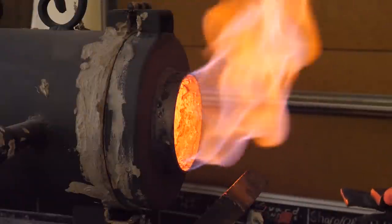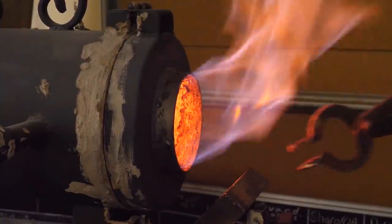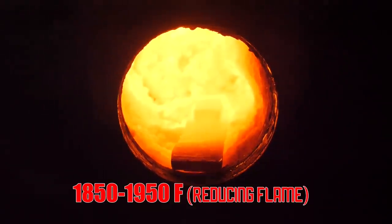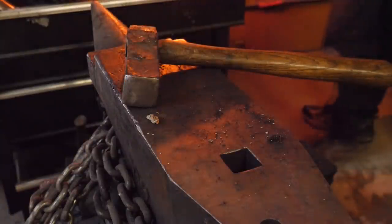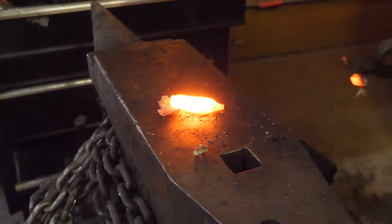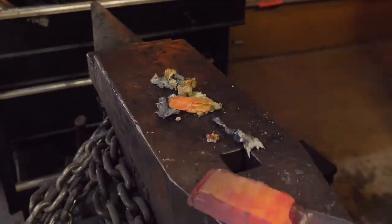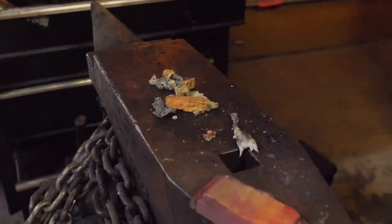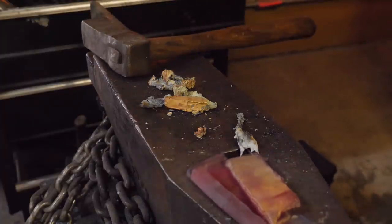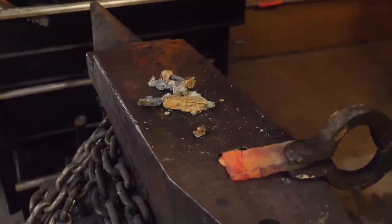This time I'm dialing in a reducing flame — one that has more fuel to consume than oxygen available. On my forge, this flame has a blue-to-orange tongue and a dull hollow roar, and that's how I know it's a reducing flame. As you can see, despite the high temperatures, it's not oxidizing this time — that means we've got all or most of the oxygen out of the forge. I dropped the piece before I had a chance to hit it, and the smaller pieces oxidized immediately as their surface area got larger. There's still a chunk of it lodged to the steel encapsulation, and I hammer it — it seems okay, but it's breaking along pre-existing cracks. After reheating, it's still breaking up along previous crack lines and barely moving under the hammer. Same problems as last time.